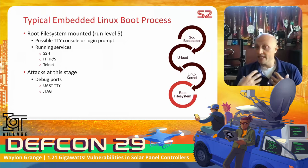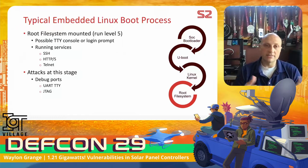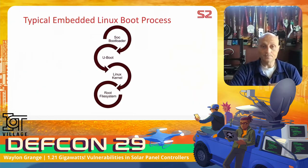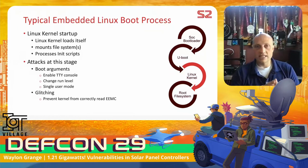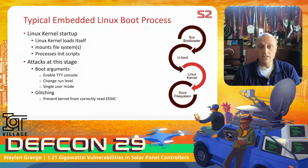The UART did output data but would not accept any input from the command line. It's always worth connecting to see if pressing Enter gives you a shell — I've seen that before — but in this case the kernel was not accepting any UART input. It would output boot messages while the kernel was booting, which was somewhat helpful, but nothing in there easily broke things down.